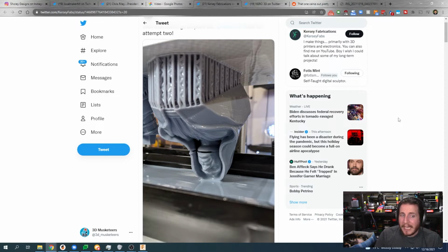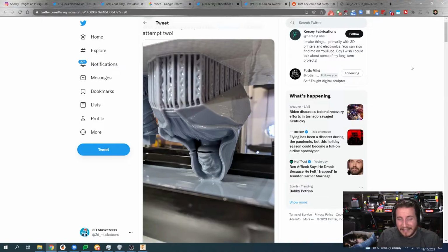Now, we don't see any peeling from the actual plate itself, and it looks like all the support has clearly grabbed a hold of that model. So if your support doesn't fail, if your build plate adhesion doesn't fail, and you've got too much suction force, what has to fail? It's the layer. Now, we could have had part of the layer get stuck to the FEP for a little bit, and then eventually it somehow bonded and pulled itself off. I don't know. I don't want to speculate on that one, but this is, generally speaking, a peel force problem.